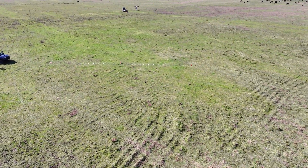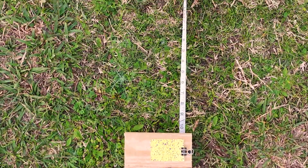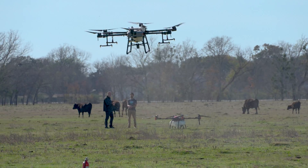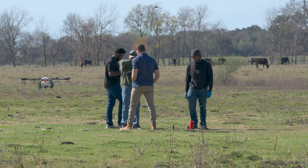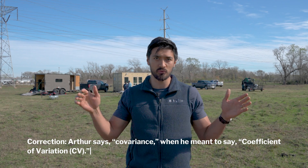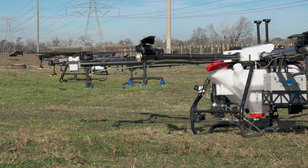The first portion of the day we're going to do spray testing. We're going to lay out spray cards that are hydrosensitive, meaning they collect water when water is sprayed on them. We'll lay them out at about a 75-foot width with three feet of spacing between them, run all these drone models across them about three passes each, then collect the cards to see the spray pattern, the effective swath width, droplet count, and covariance across the swaths — giving us an apples-to-apples comparison.